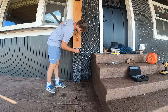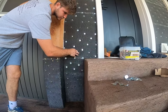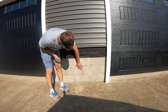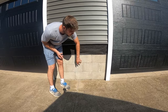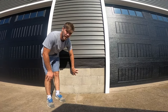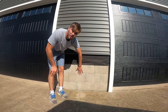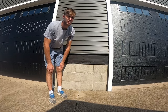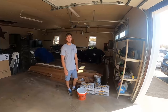When it's directly on wood or plywood, use a nail gun. When you're putting it on foam, use all these screws. The only time you don't have to add wire is when you're putting it directly on bare block - bare concrete block with no paint or sealer. You can put your scratch coat directly on it and start laying. The only reason you'd put wire on block is if it was coated with some sort of sealer or paint. If it is painted or sealed, it prevents the mortar from bonding. I've seen stone fall right off a painted block wall probably a dozen times. Don't ever put a scratch coat on a painted block or superior wall without wire lath first.